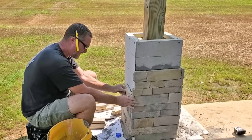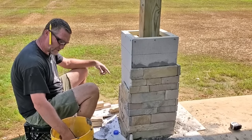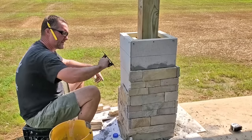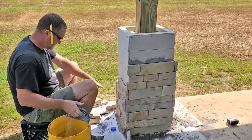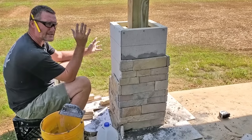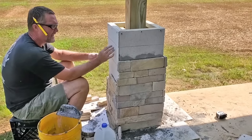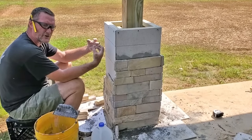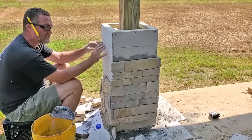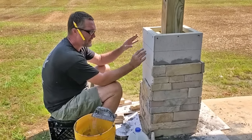Also, one of the things I found, I was trying to take the base coat, veneer both base coat, and put it on the board, trowel it, and then take the stones and set them. But I think between the heat outside and this cement board being very dry, that dry board sucks the moisture out of that mastic, out of your cement, and it dries too quick. I mean, it dries within minutes. So they wouldn't stick good that way.